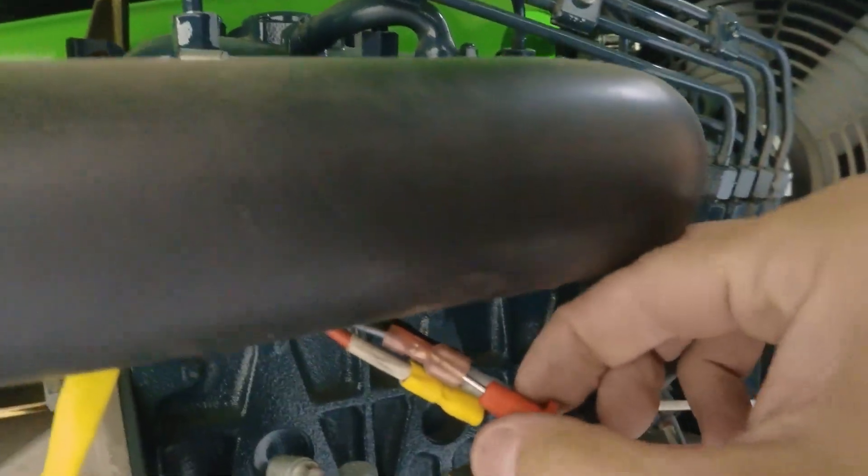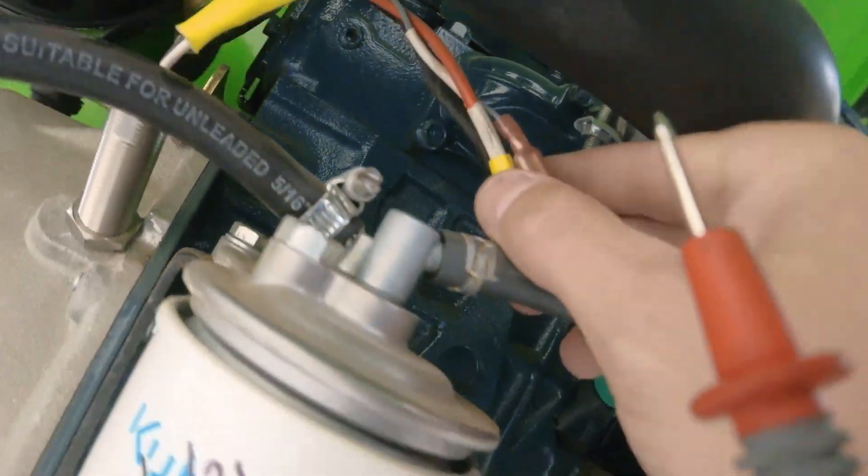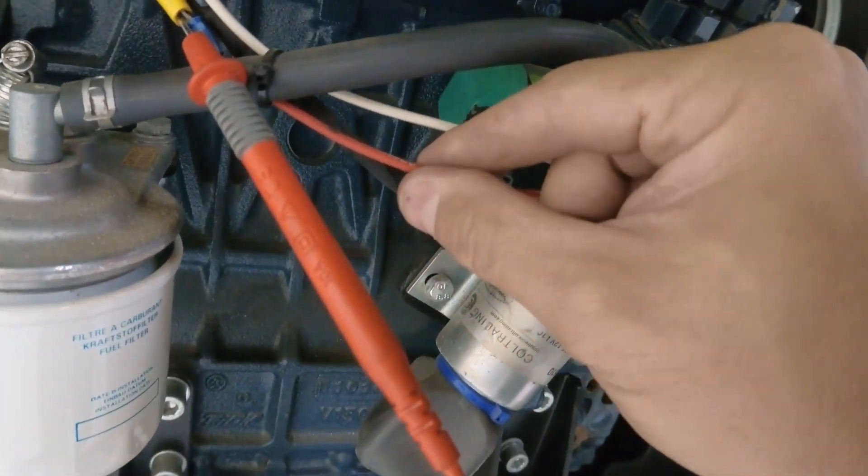I would expect that to be a bit higher, but at the same time maybe it's a problem with the multimeter not being able to pick it up fast enough. So we should try to measure the hold side — the red wire is the hold coil, and that should have 12 volts constantly when we're in high revs.